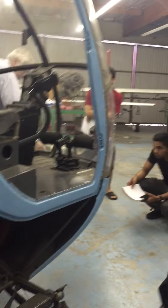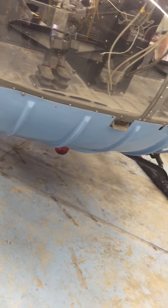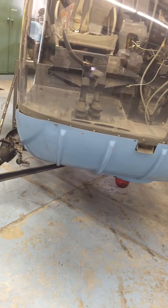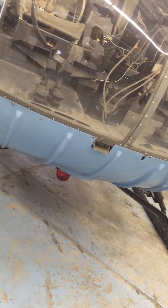There's a pitot tube. It's a very simple machine. This engine probably weighs 350 pounds. Gross weight is 1,600 pounds, so it's about a quarter of the gross weight of the helicopter. I think it's about a 25-gallon tank — about 150 pounds of fuel approximately. So between the engine and the fuel, we're looking at about a third of the takeoff weight of the helicopter.